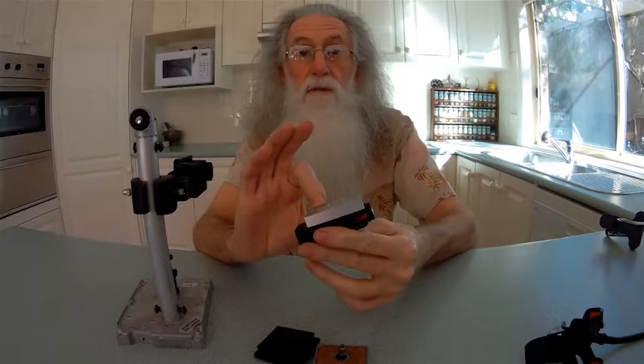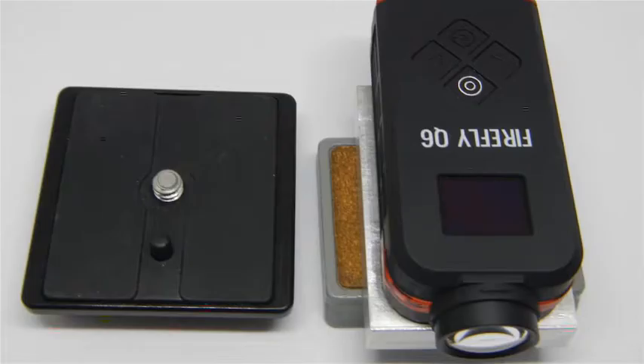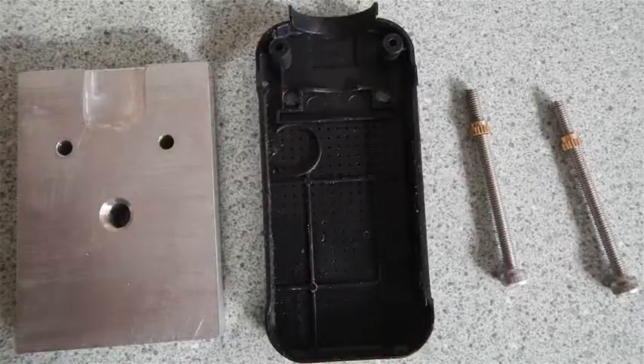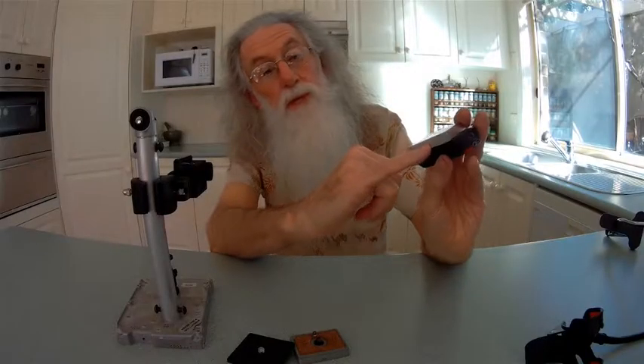I made this jig up for two reasons: it's got the tripod mount so a Manfrotto and all other types fit in and screw in — that just needs to be a minimum of 5mm, I had 10mm, so that works fine. I can use it on any tripod with a quarter-20 thread, no problems. You get your little brass insert, 3mm long — I machined mine up, bought 10 and cut them in half, faced them to 3mm. Then you get your long M3 socket cap screw and screw it in so it just protrudes. These holes then act as a guide, because when you get something hot and push it into the plastic it goes in beautifully, but you let go and it will fall over. So eliminate any errors with the guide.